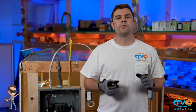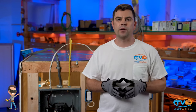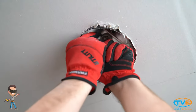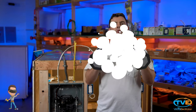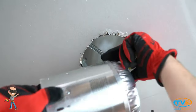This is still doable. The first step is to turn off the power by either flipping the breaker or turning off the switch. Next, you want to unscrew the screws that are inside the can light towards the bottom of the light. These screws are attaching the can to the frame. Once they are all off, you can either push the can up or pull it down — it just depends on how much room you have up in the joists.